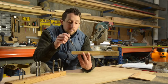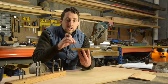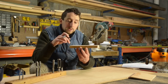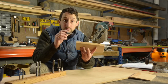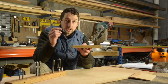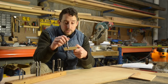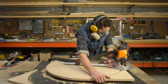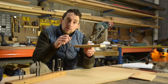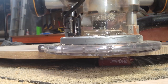You'll always need to experiment to get the best effect. I've found that these get the smoothest finish when you're cutting off as little material as possible. So if you can trim it up with the bandsaw first, get it pretty close to that line, and then just cut off a millimeter or two with these, they work beautifully. I have pushed them through the full width of the blade to do full trenches or full-depth cuts in timber, and they work fine — but I've wanted to go back over them to clean up those cuts a little bit, just to get the really glassy edge that these bits can achieve.